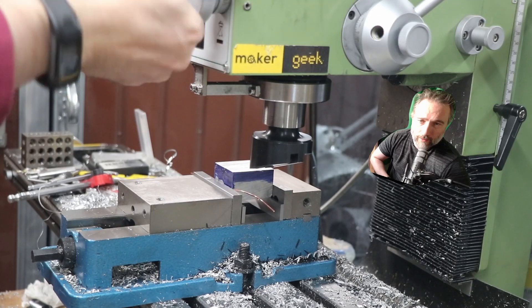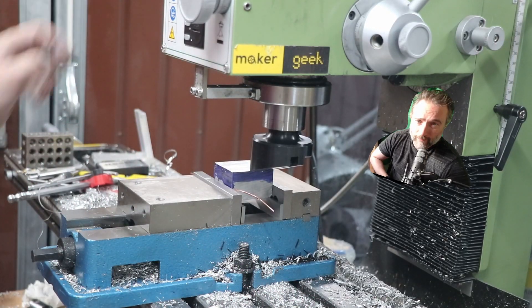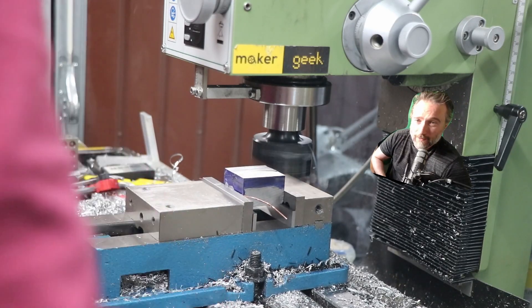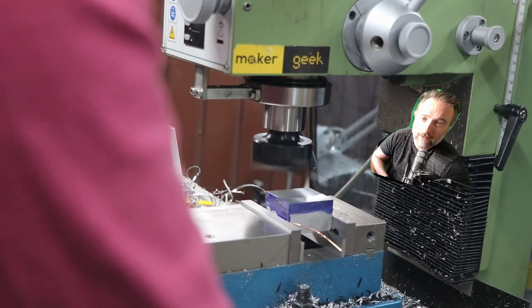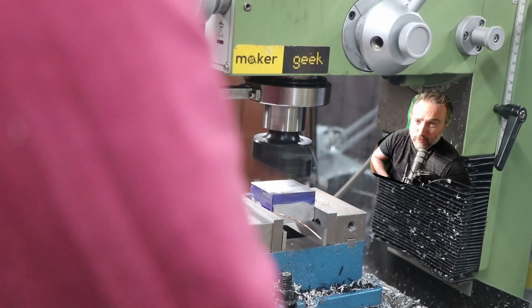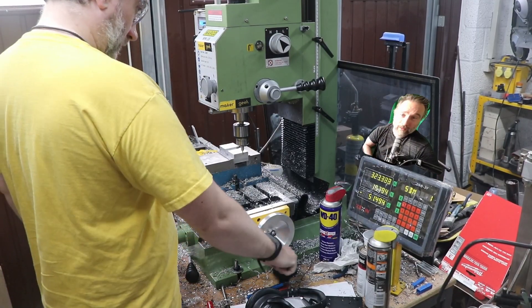A lot of those flat brackets were pretty straightforward - just drill a bunch of holes in a pattern. This is a little bit more interesting: making up the block for the ballscrew nut connector. Fly cutting to get myself square, with the approved machinist copper wire there just to hold the inconsistencies on the non-machined surfaces at bay. And if you want to look professional machining, make sure you spill blue dye over all surfaces so it looks cool when you machine it off again. Here we go - edge finding.